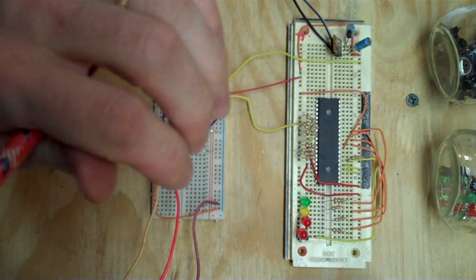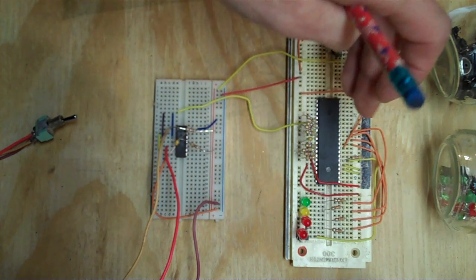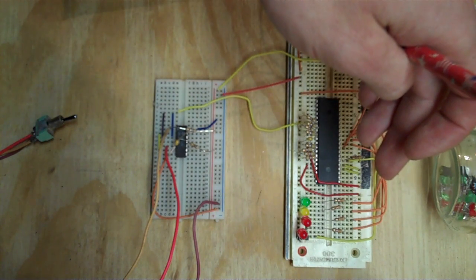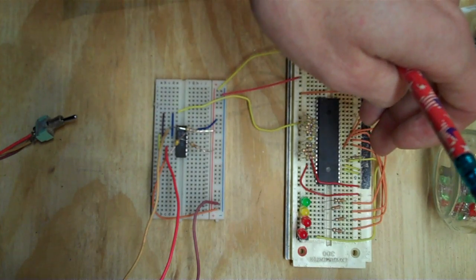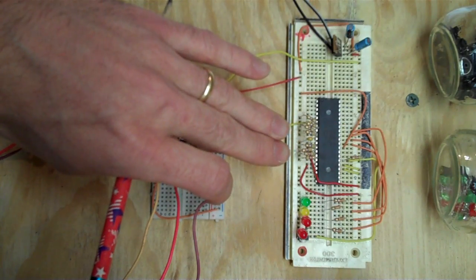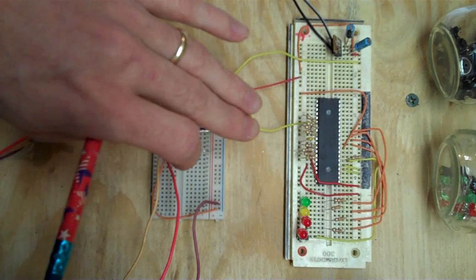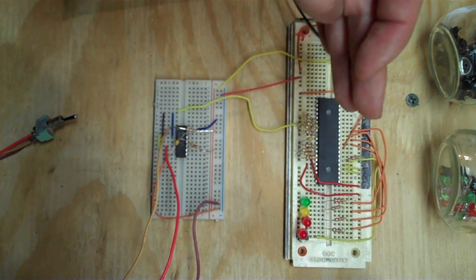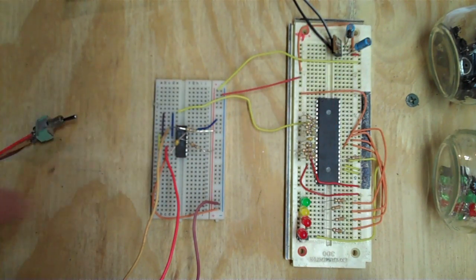So you could write to memory by asserting the address of the memory cell on the address bus. You'd flip on the write and memory request lines, and then you would punch the data bytes out on the bus. And you synchronize between the various devices by using the clock source, which is this here, and we'll get to this in a second.